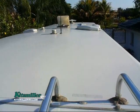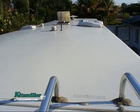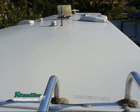The first thing we're going to do is make sure that the roof is basically clean — all the big debris and yuck — you need to get as much off as you can. Sometimes you might want to wash it and let it dry before you start touching up sealants. The biggest reason we're looking for gaps in the sealant is because that lets water in, and we don't want water getting inside the walls — it usually doesn't show up on the floor for a great period of time.